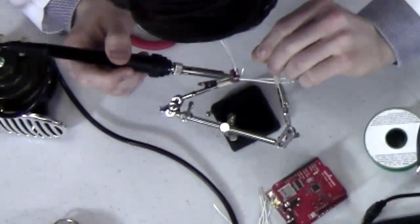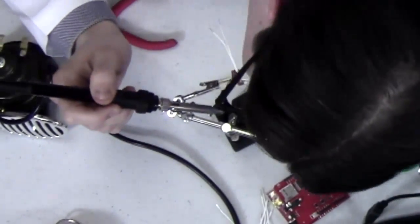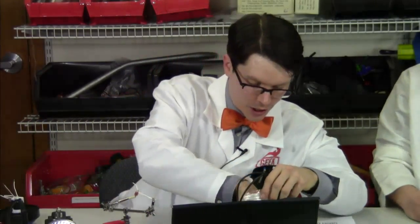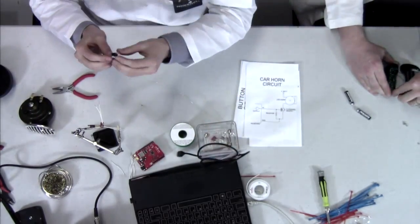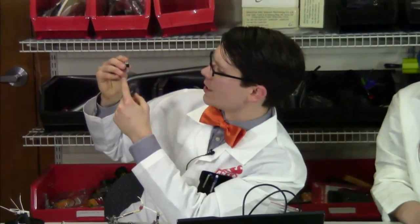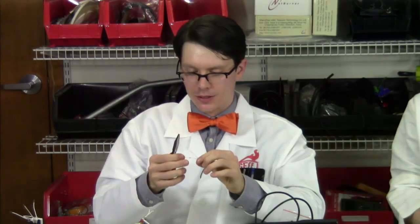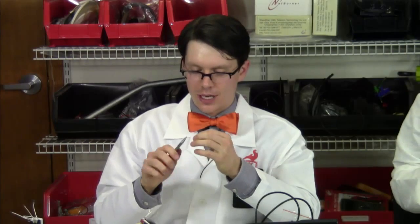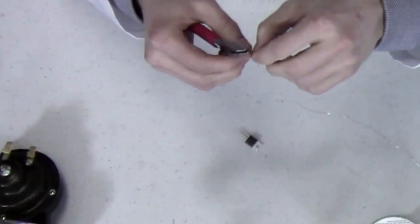I'm just finishing up this connection. Now I have everything all soldered into place. I want to pull out the N-channel MOSFET — the way to remember the pin order is you read across the side: gate, drain, source — GDS. We're going to add a pull-down between the gate and the source by making two little loops in a 10K resistor near the body of the resistor, with full loops so we can attach it to the MOSFET pins.